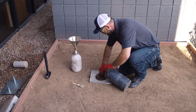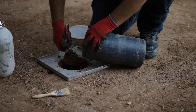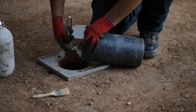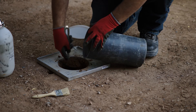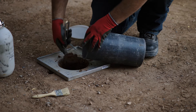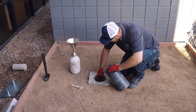It's important to keep this bucket over the surface of the test so that we're able to retain any material that falls or sloughs down while transferring it into our bucket. One other consideration is moisture content — while we're performing this test, our material is drying back, so we're going to use this lid to capture and retain that moisture.